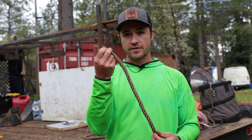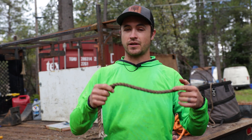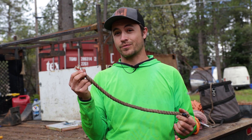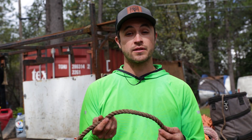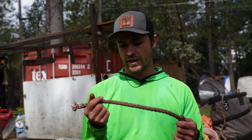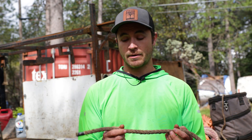There are some severe downsides to this. Because it's twisted, if you pull on it, it tends to untwist — so if you put a pulley on it, you'll twist up your pulley. If you're doing a lot of rigging with heavy loads, it'll want to spin. It also has a lot of stretch, so if you're dealing with tight confines and can't take all that stretch out of the rope, that'll be a problem. The primary advantage is that it's cheap, and who cares if it wears out fast?